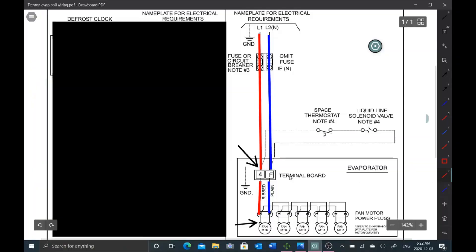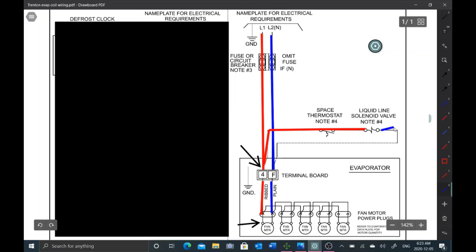We do have power at the solenoid. That tells me this thermostat is in the closed position — we're going to complete our circuit. We need both sides of the circuit to complete it, so that tells me my neutral side is coming through as well. Our circuit's complete. Now this is telling me my solenoid has power. It doesn't mean the solenoid is working and opening, but we do have power there at this point.